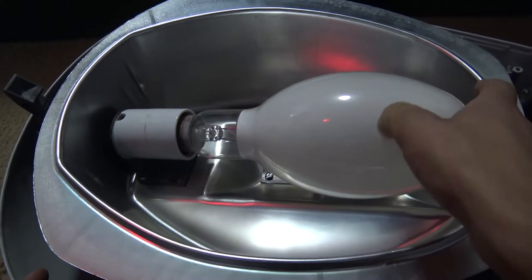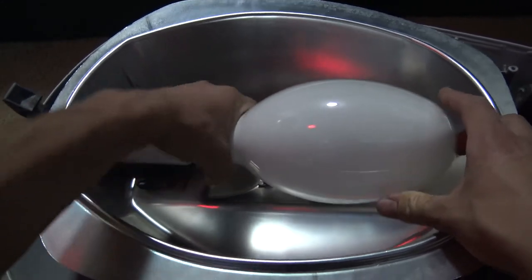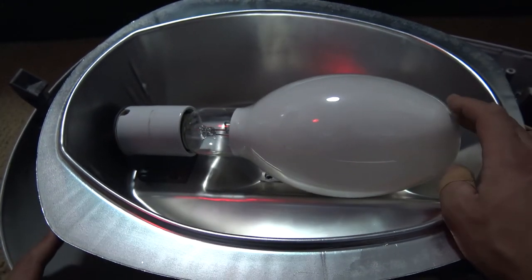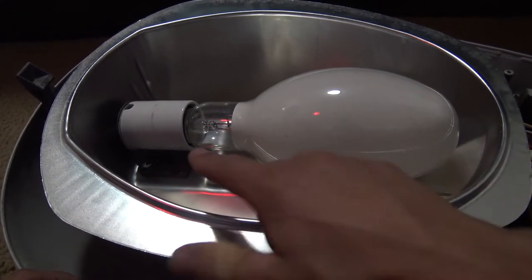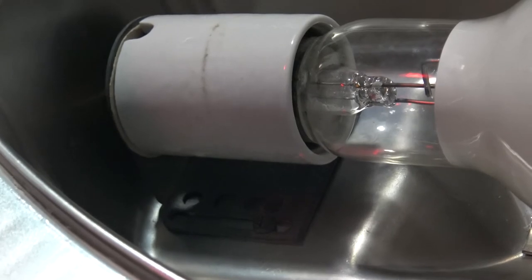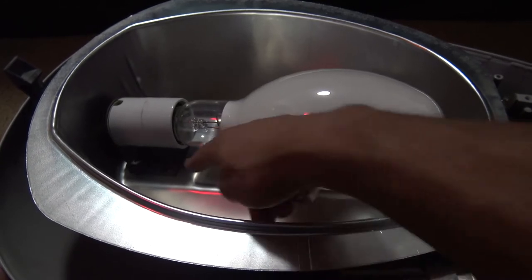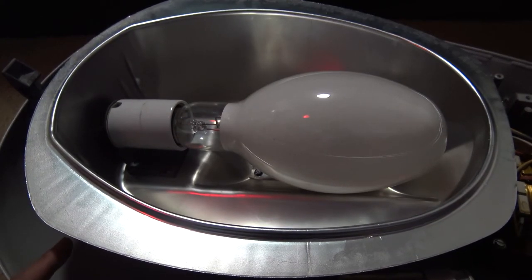Here is a standard mercury lamp, and here is the problem. If we screw it in here, you can see it sounds like it's hitting on something — this lamp is actually very close to, if not actually touching, the reflector. It's not good at all. You can actually adjust your socket positioning — all you've got to do is loosen the screw and slide it forward or back. There's another screw here that has some steps, so you've got your ABC steps. But you can only have it in one position, because if you try to move this forward it's going to hit the edge. So this is completely flawed for a mercury lamp. For an HPS lamp, I think an HPS lamp will do fine in this.